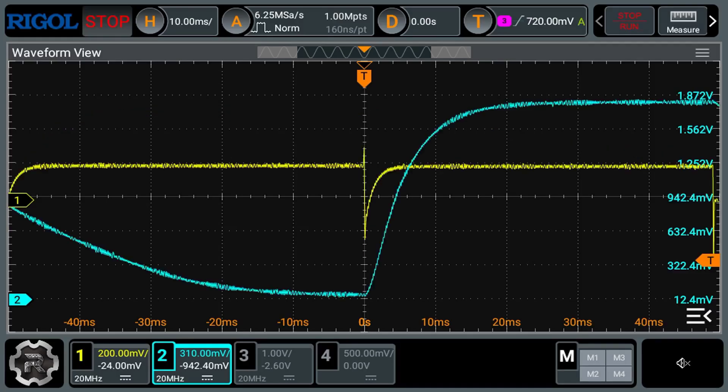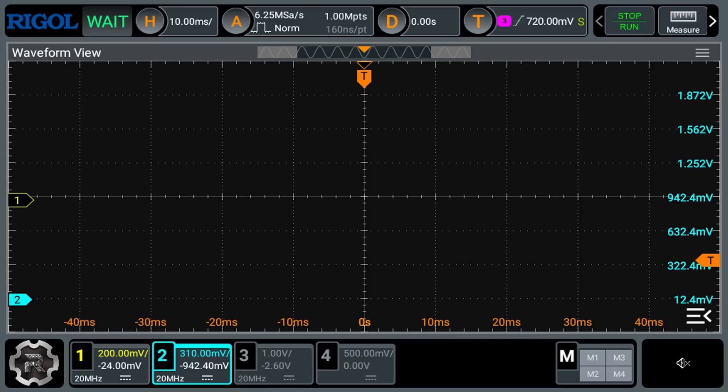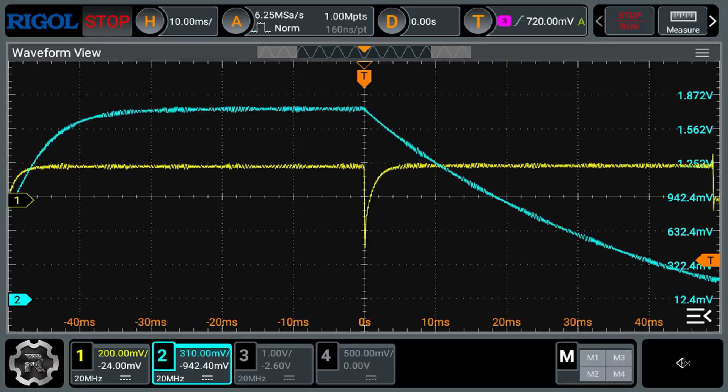Here is the rise time for the L4A sensor. If I remember right, 10 to 90% was about 8 to 9 milliseconds — so that looks correct, I don't think I've damaged this one. The fall time is right at 50 milliseconds. The L4B sensor board rise time is very close to the L4A board. Not quite as much output, but that is probably just sensor-to-sensor differences. Fall time is also about the same as the L4A board, so I don't really see any difference between the L4A and L4B.